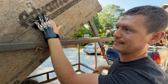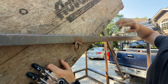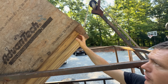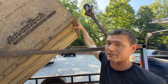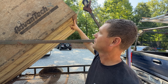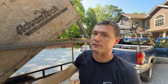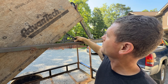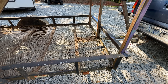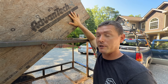One really important thing is that I nailed the Advantech to the side of the two-by-ten on each side — some three-inch galvanized gun nails shot in. There's a piece of two-by-two angle iron at the front holding everything together. I could probably put more screws or bolts in it, and if anybody else does this they could probably make improvements on this design, which I'd actually recommend. I didn't ever really have a goal for how high it should raise — I just wanted it to raise enough where stuff would slide out. I've always thought it was about 45 degrees but now looking at it with a square, it actually only raises to about 40 degrees, and it has been high enough to dump really anything out of it.